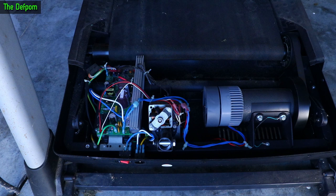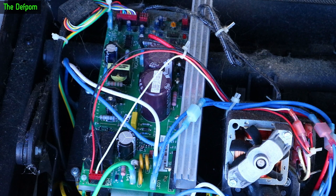That was actually surprisingly easy — three screws on the back, two screws on the side one each side, and then the top cover lifts off and you can access everything. It's pretty dirty in there. One thing my wife described: when she powered it on, the belt moves straight away, which should only ever move when you tell it to start. That could be a sign of a shorted drive or motor controller output. Or it could just be that there's so much gunk on the board it's shorting something out — it's in a garage, possibly even bugs have died across it.